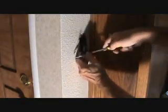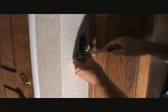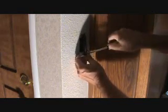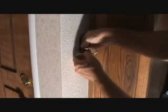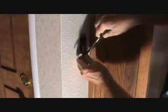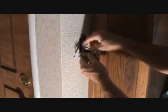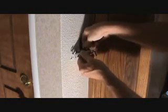You don't want to do this hot — you could shock yourself. Even a professional electrician has certain ways they could probably do this without getting shocked. At this point, don't ask yourself any questions about white and black wires — there's supposed to be a black power wire to each one, but I'll explain that in a minute. Now there's a curlicue on the end of each wire, and I might be able to take my screwdriver and kind of tweak on it a little bit, try to fish this out, maybe bend a wire and push up on it a little bit. There it goes — I've got that one, now I can unscrew this one or just pull it off like that.